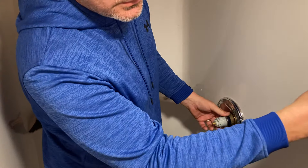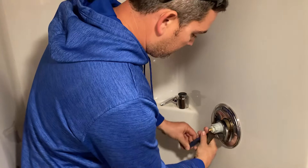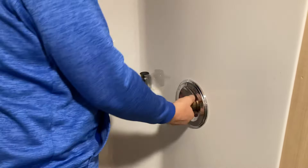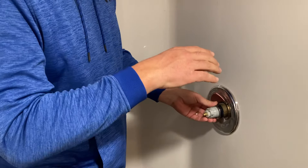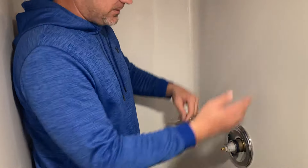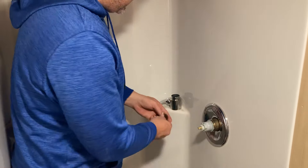This is the only one you may need a pair of pliers for. Make sure your water's turned off first — it's underneath the house as a ball valve. Turn the shower on to get the pressure off the line, then unscrew this.